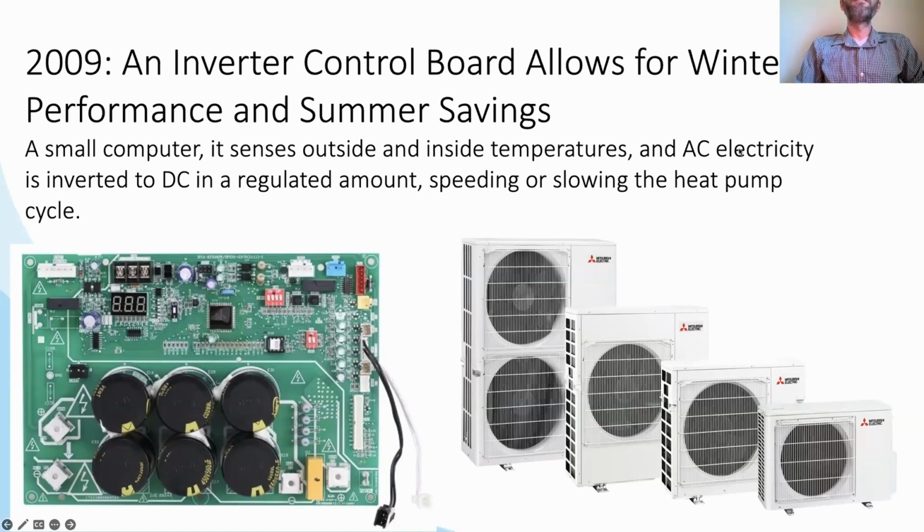Well, this is under the fire safety protection thinking, which is that they're trying to make sure that this 50 amp circuit doesn't exceed its total rated thickness of wire. If that NeoCharge was able to give a signal over to the heat pump to say turn down as opposed to turn off, and that is something that NeoCharge is making, a whole home system to be able to coordinate that with the central panel. So yes, but it's pretty sophisticated getting these different manufacturers' computers to talk to each other. Like you all have problems with your routers and your headphones, and it goes on and on. So don't assume that's a simple thing.